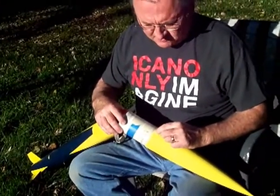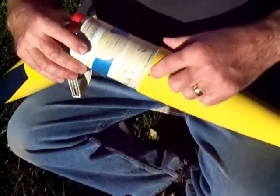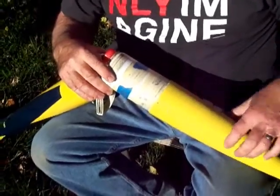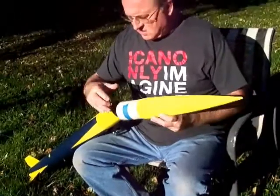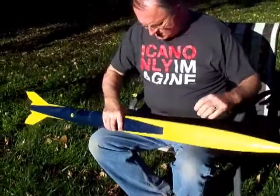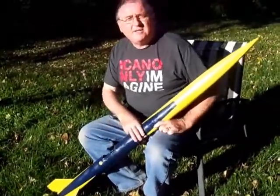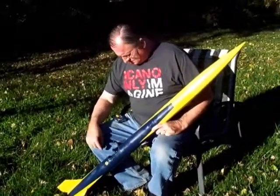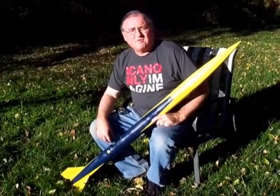I drilled a couple of holes in the nose cone, and these two allow equalizing pressure with the altimeter. Of course, the location of these vent holes is far from ideal because it's close to the curvature of the nose cone, but it may be good enough to get us some kind of altimeter measurements that make sense, at least on the way back. So, with a little luck and a good roll of duct tape, we'll shoot it off with an H242 and hope for the best.